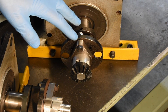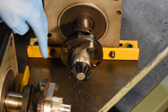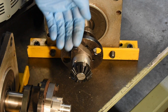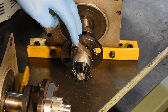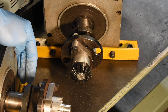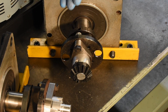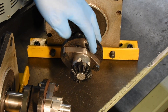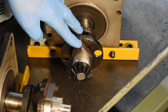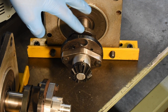As you can see, obviously there's friction there — it doesn't continuously spin. If I wanted to apply a certain amount of torque to the gear, say one newton meter, what will actually be applied to the gear is that amount plus or minus, depending on direction, the friction that is just from the motor. So we need to find a way to compensate for that. What I've done is spin the motor at a couple of set RPM speeds and measure the amount of torque required to do that.